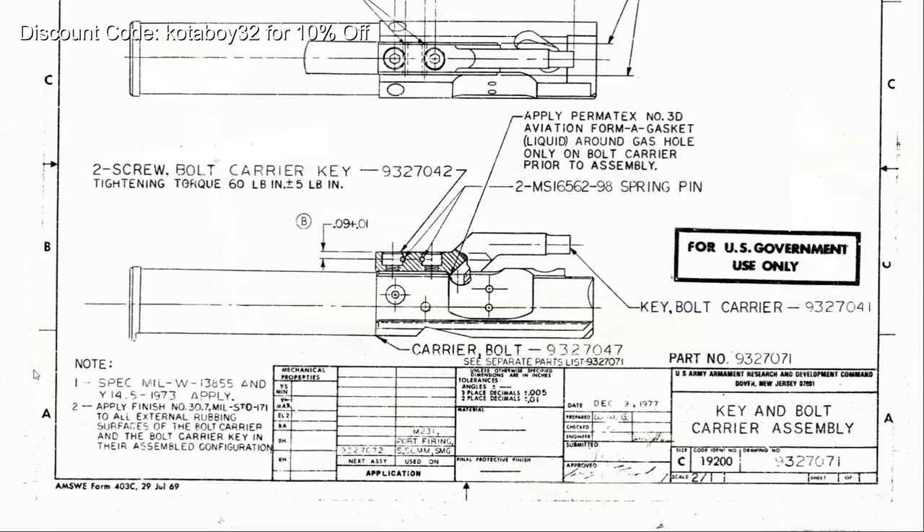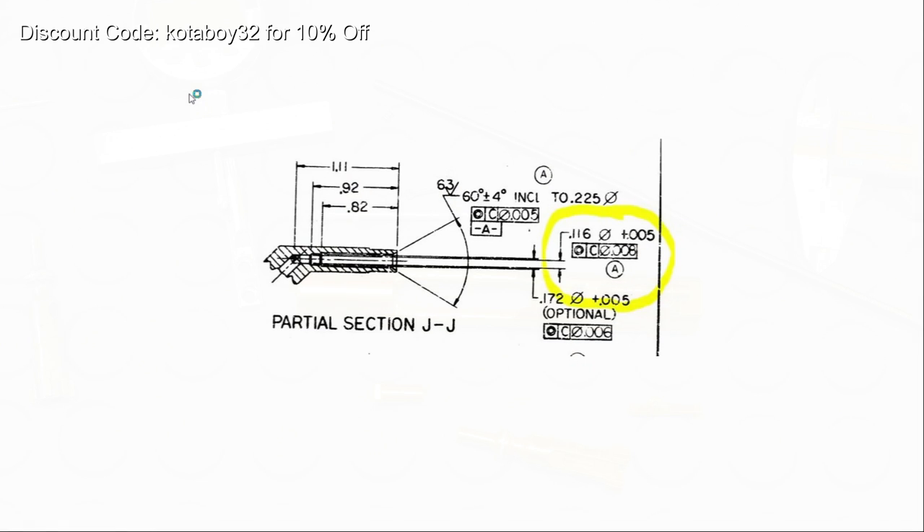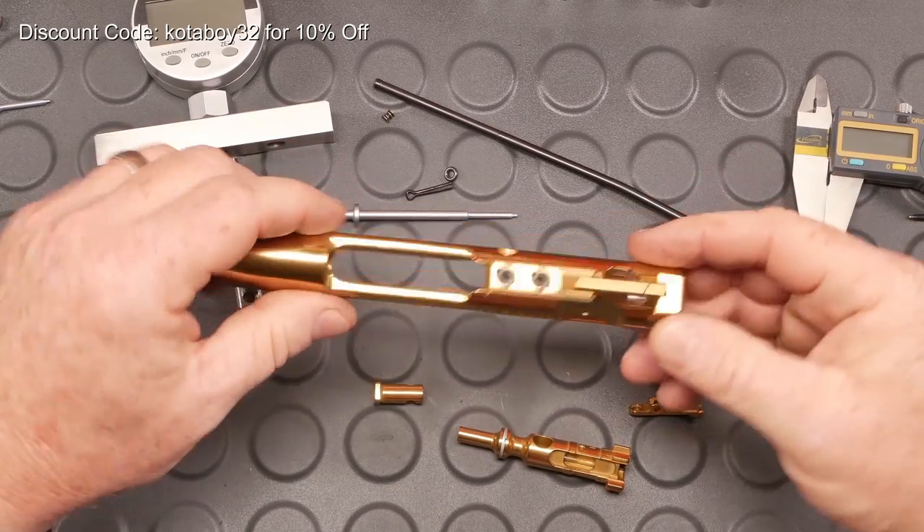Here are some unmarked drawings — these are really nice so you can tell the difference with all the dimensions. There's the screw and the carrier. Over time the original carrier was only about 5.922 inches in length, now it's over six inches. At the end of the day there are like eight areas of measurement just with the gauge pins on the carrier itself. So let's pull up all these images and we're going to talk about each individual one, starting with the gas key.